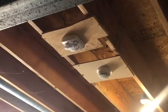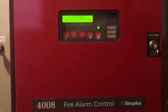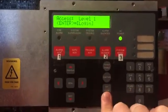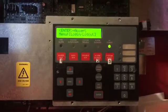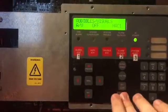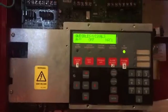So that's the update I wanted to give. I'm going to start by doing a test of all the devices — that's going to be a silent test — and then we're going to set the horns off for a little bit. I'll open up the panel, get a look at the screen, and log in to level three. I'm not going to show the passcode. We are now in level three, so I go to control, view NAC — that's the NAC for the home system.